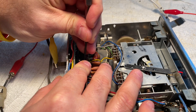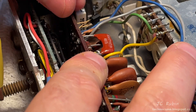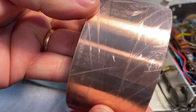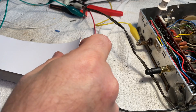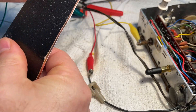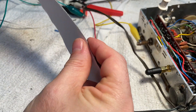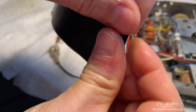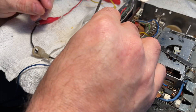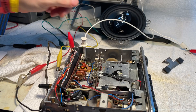First, a file will be used to shave all the sharp ends off the circuit board — every single sharp end until it's smooth. After that, I set out a length of heavy-duty duct tape and copper tape for EMF shielding. I lay the copper tape with the copper facing the sticky side of the duct tape over one side, dress it to the bottom so the copper shiny side faces out, leave a small margin to connect stuff to if need be, and fold the far side over to insulate. I negotiate the shield into the unit to determine how much needs to be cut off, cut it to size, seat it to the bottom, connect the tab, and tie it to ground.